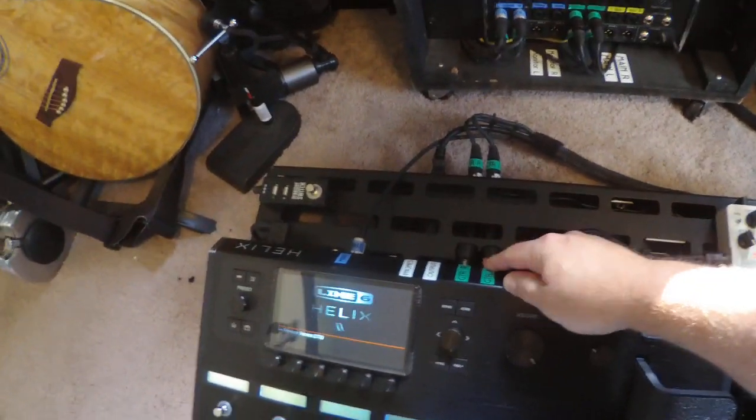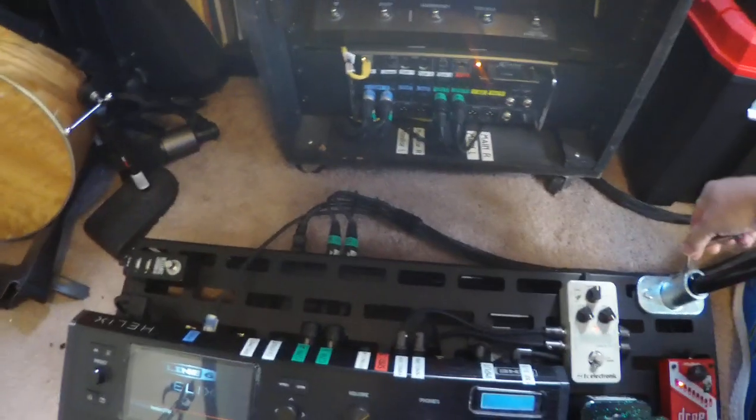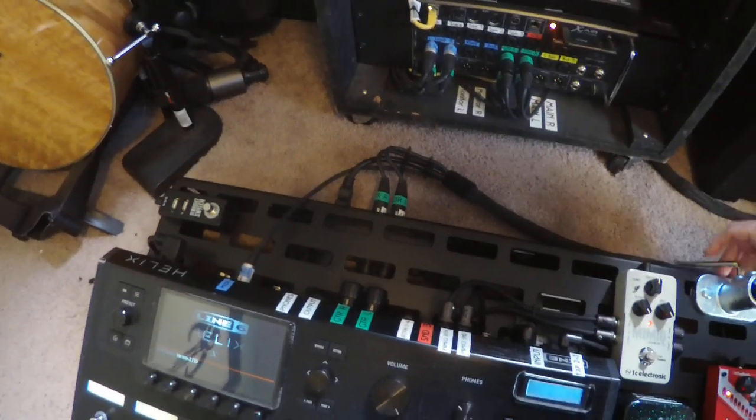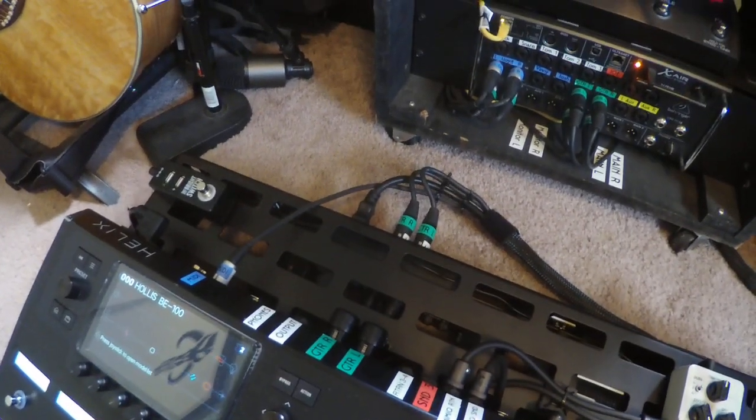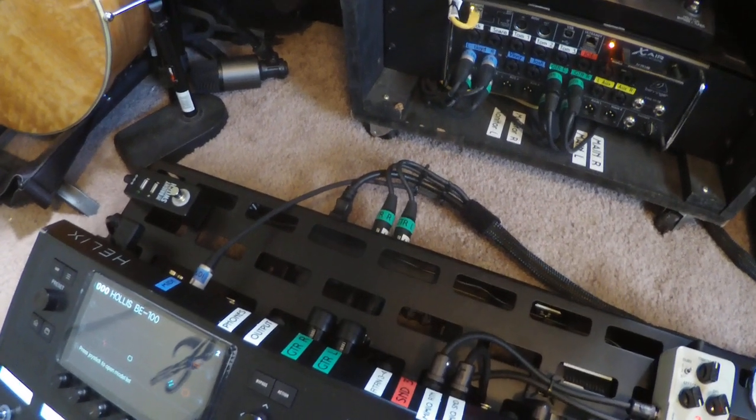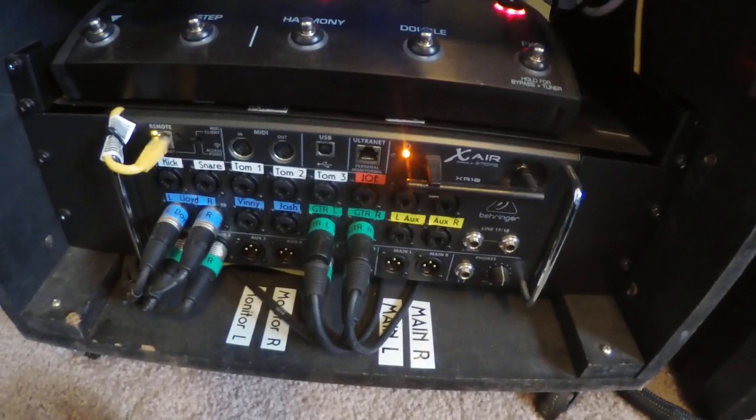The one thing I don't like about the holes is I wanted to run XLR into the mod, which is in the back. I got the version with XLRs, but I do wish it had MIDI. The only thing I can't run cleanly is the MIDI — I had to run a special cable just for that. They have one with quarter-inch jacks but not MIDI, or quarter-inch with MIDI but not XLRs with MIDI. I run stereo, so everything color-coded green runs right into my XR18, and my outputs go to my Sennheiser for my IEMs.